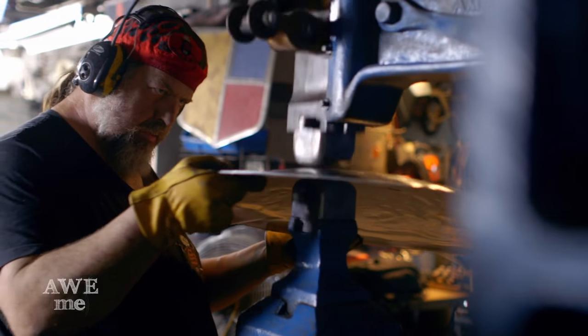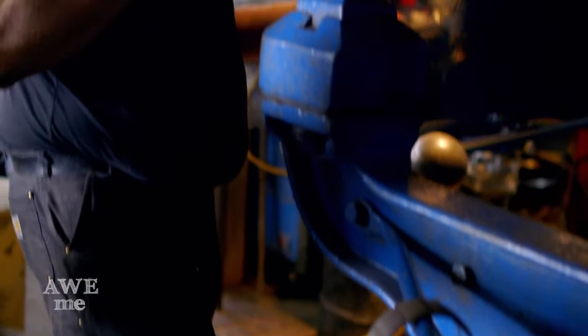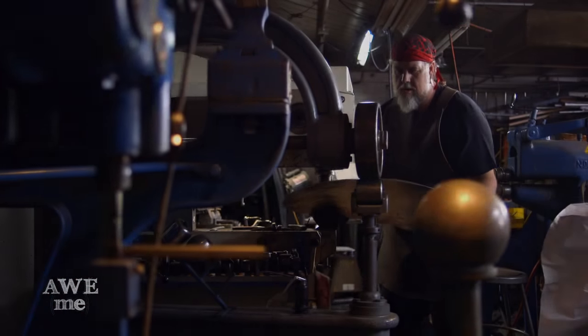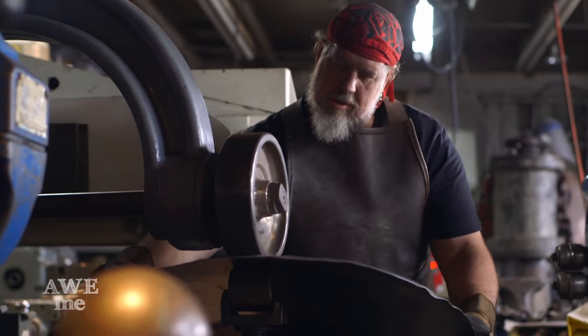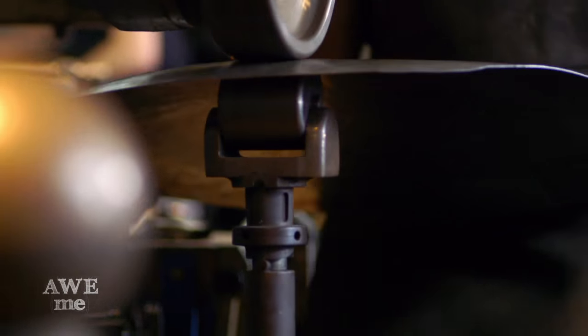A Pettingill hammer is comparable to about a 90-pound forging hammer. It hits up to a thousand times a minute if I step on the treadle and just go for it. And now I'm smoothing it on the English wheeling machine. These were used to build airplanes and car parts for the British war effort during World War II — an appropriate time for Captain America.